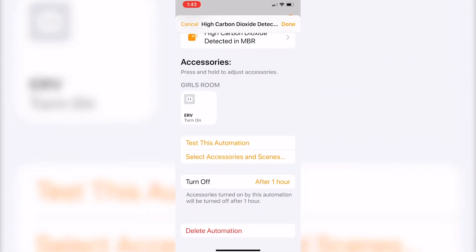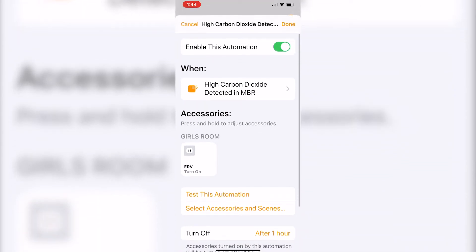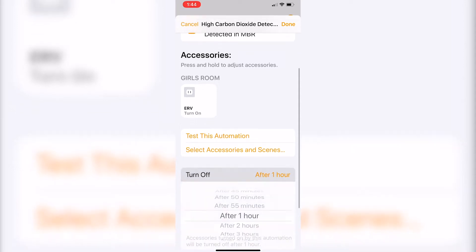It's likely to go on at night. So if I breathe on the device, it'll actually turn on my ERV. It will stay on and shut off after an hour once the CO2 has come back down. I haven't fully tested whether it runs for a full hour and then shuts off, or whether it shuts off once it achieves below that threshold. Based on the testing I've done so far, it seems like it keeps the ERV on as long as CO2 is above the threshold, and once it drops below, it runs an additional hour — which is sort of my desired setting. I can still adjust the turnoff time if needed.